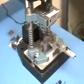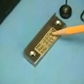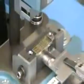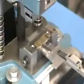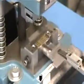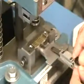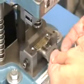The insert is a very critical part of the tool and is easily removed for changes in shoulder dimension, radii, or material thickness. It is very easy to change. The backstop, which controls nesting of the body, also has an anti-tilt mechanism that is useful in securing larger parts.